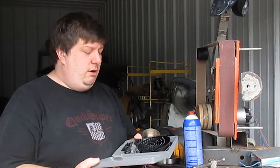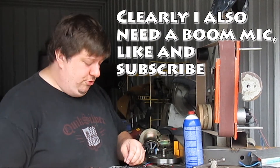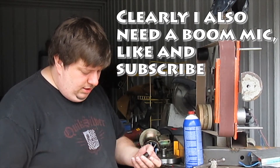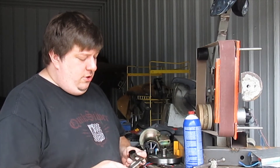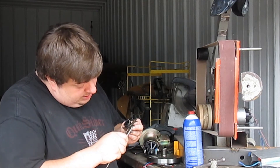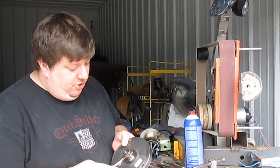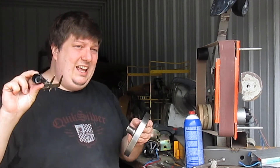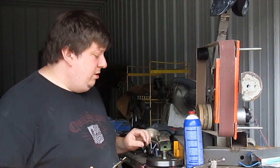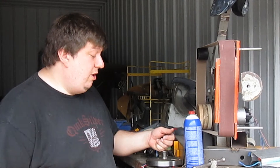So the second thing I need are my hole saws. After just kind of sifting through my hole saw apparatus, this hole saw is exactly 28 millimeters. This is 28 and a half millimeters, so this is slightly smaller than this. So in the end, what I actually need to do is make a wood donut that just barely fits with force over this connection here. And that's step one.